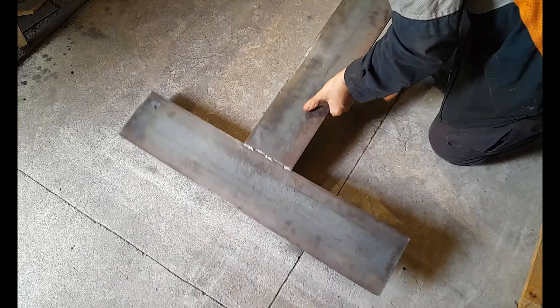Once you've got that 300 millimeters cut and those holes drilled at 35 and 95, take a piece of your merbau and measure 150 millimeters in length of your 140 by 20 merbau, and cut it at 150 millimeters long. This is my existing bracket that I'm about to cut down — it was too long from my three degree of freedom motion.